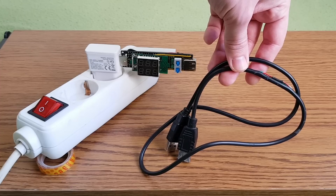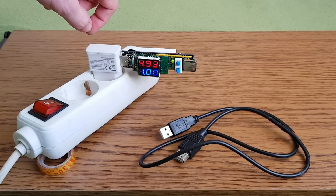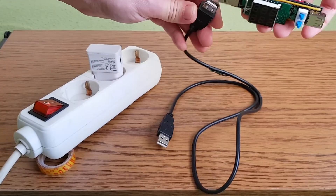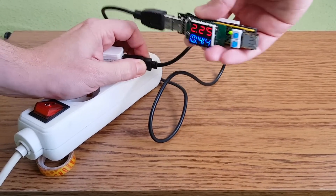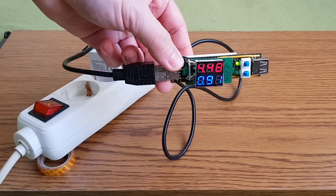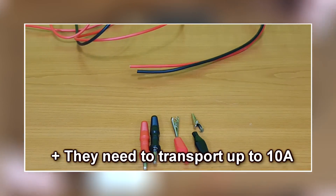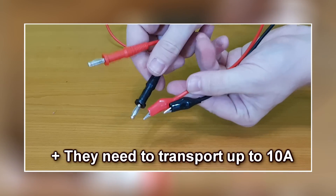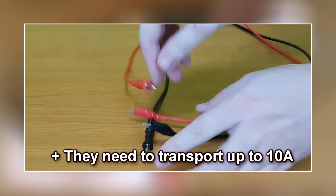The best example is this USB extension cable. I'll use this phone charger and one load resistor — the USB tester shows 1 amp. But if I connect the USB extension cable, we lose 90 milliamps and some voltage. That's why I've used heavy duty cables for my power supply leads — I don't want them to alter my measurements. The thicker the wire, the lower the electrical resistance.